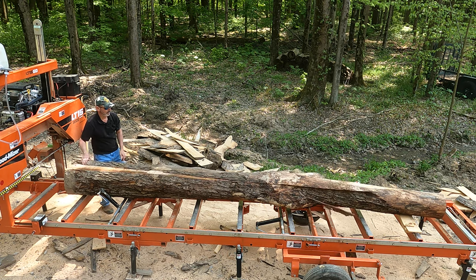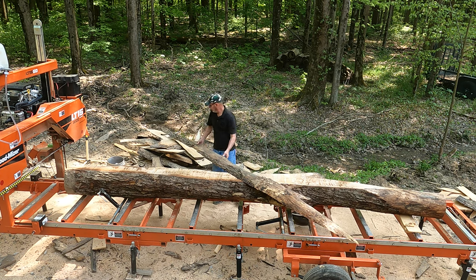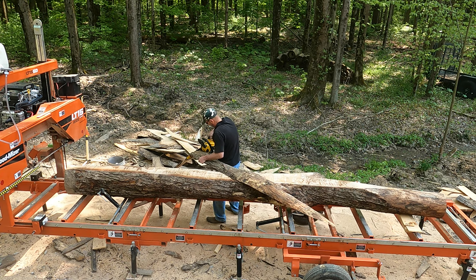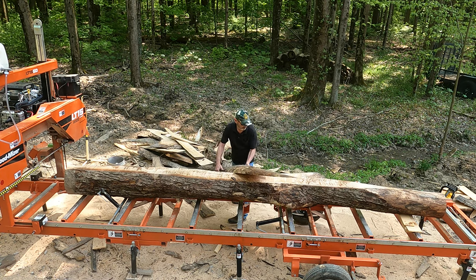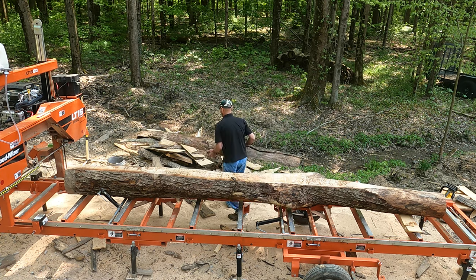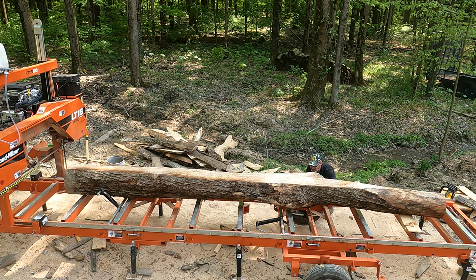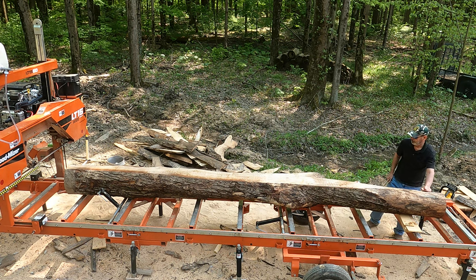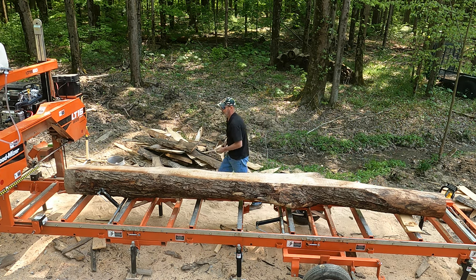It's not just a bow, it's got a hump in the middle. Oh yeah, I'm cutting this stuff. It's not bad looking wood. Got a little bit of figure, but I gotta go down more. I don't think it's gonna make 8 inches. I might be able to do 8 wide. I don't know. This is gonna be a tough one. I'm going down another inch. We'll see where that puts us.